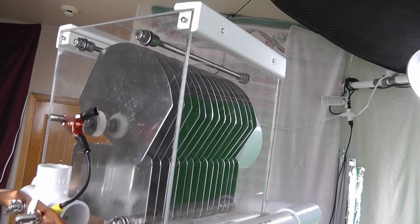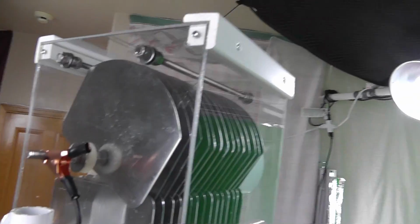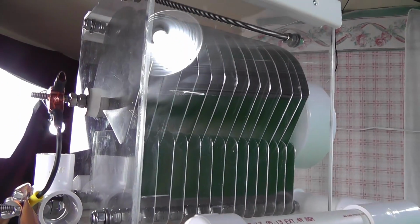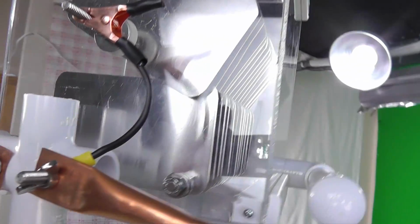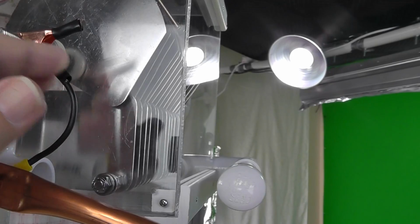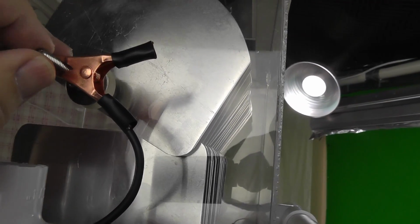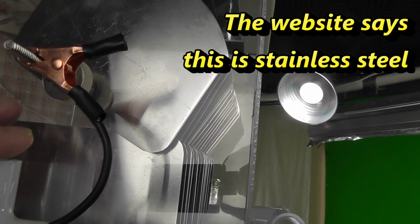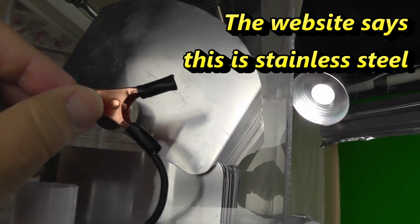It's not wired with two stationary halves and a butterfly in between, but rather just as an ordinary capacitor, which means that you actually get more capacitance out of it. Now, the way that this is connected to the loop right here is via this little clip right here, which is made of copper, which clips onto the aluminum,